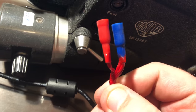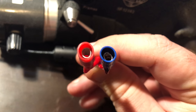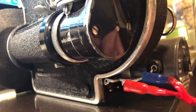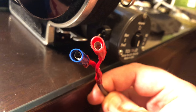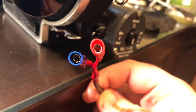Once you do that, it doesn't look amazing — it's just kind of a rough job. There are obviously better ways to do it, but this is the cable — that's the basic way of doing it if you want. Excuse my poor camera work here, but they just fit right on and they grab. They just go right on, and once they're on and they're crimped enough, they pretty much just stay there and stay connected. It takes a pretty good amount of force to get them off once you crimp these down just the right amount to squeeze it properly. You can see the negative terminal — the blue one over there — I had to crimp that a little more to get it to hold onto the smaller terminal.